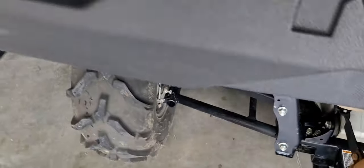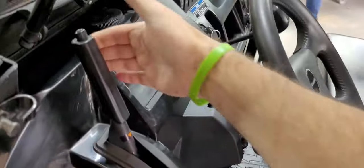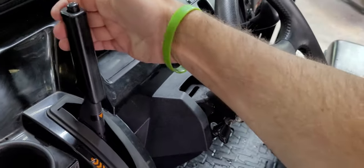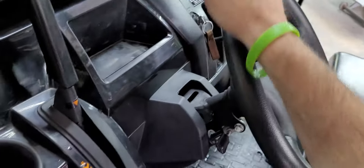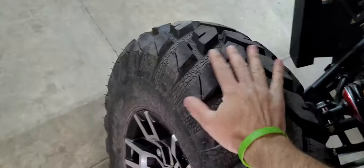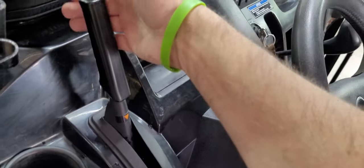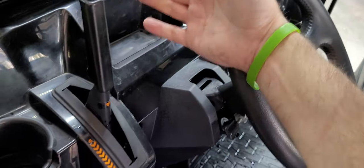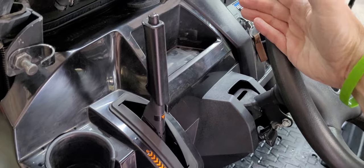Once it's all done — now granted this machine has a cab and everything — you come over here and make sure... look at that. Turn it all the way off and I could actually move the machine a little bit. You can see I can move it pretty easy, so no brake drag. You don't want to hog this thing back — you just want to feel it till it touches, maybe another click.